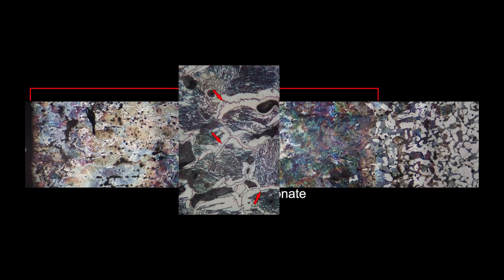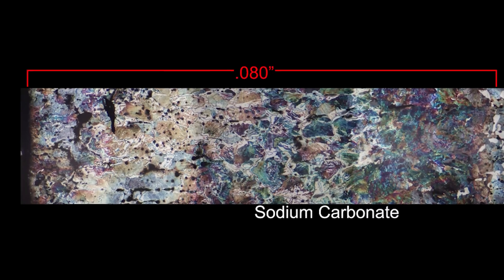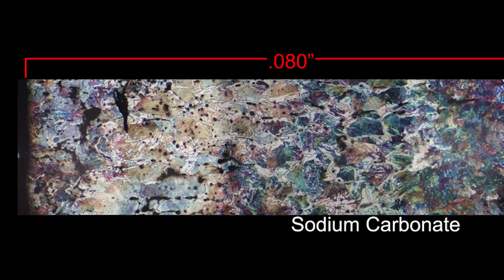The sample from the sodium carbonate mixture is a different story, with a carburized depth of almost twice that of the calcium carbonate treated sample. More importantly, between the pearlite grains are healthy amounts of pro-eutectoid cementite. This means that in the first half of the carburized skin, carbon levels exceeded 0.8%, enough to form carbide networks. The skin therefore has more than enough carbon to share that the process of welding up shear steel would redistribute it to the small ferrite core and most likely produce a good high carbon product overall. While results seem clear that sodium carbonate is the preferred activator, I still can't entirely give up on calcium carbonate since it was a very popular activator historically.